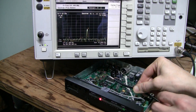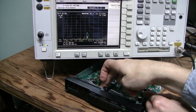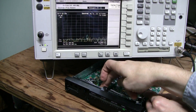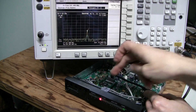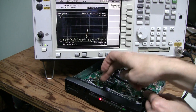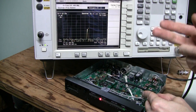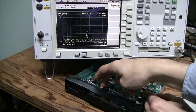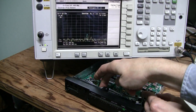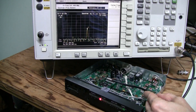I also found that this way of testing — touching the trim cap with my finger — is wrong. I can disrupt the oscillation by doing so, but I believe this is because I introduced the capacitance of my body into a critical part of the circuit. I checked, and I can do exactly the same with the working unit, so it does not mean a thing.